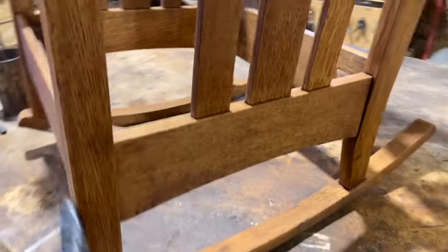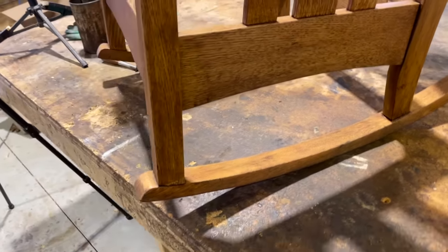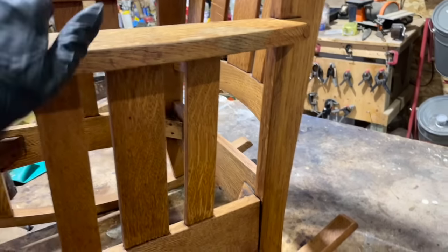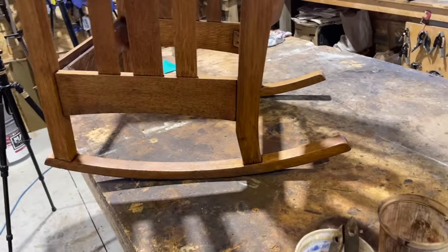And then we're just gonna be doing a light sand. So until I really know what I'm doing with the oxalic, I can't do a bunch of sanding, but I'm gonna start taking care of those areas. And yeah, it's still good and sturdy, so I don't wanna take it apart at all. But there's lots of those little marks everywhere, so I'll get to doing that.